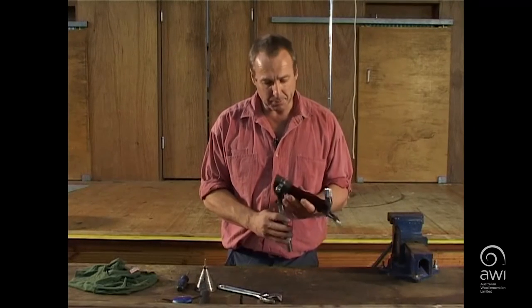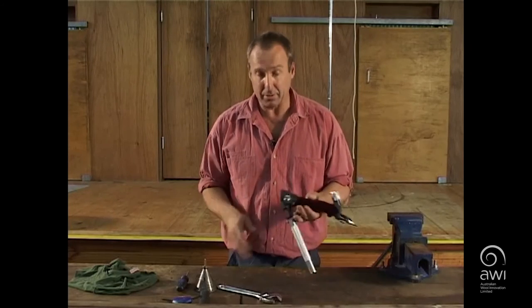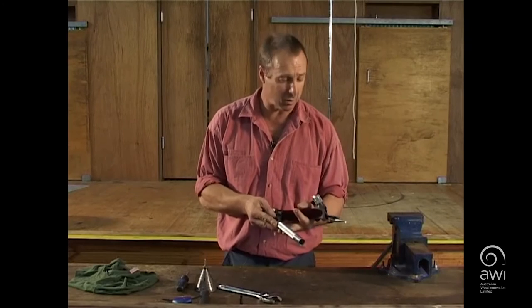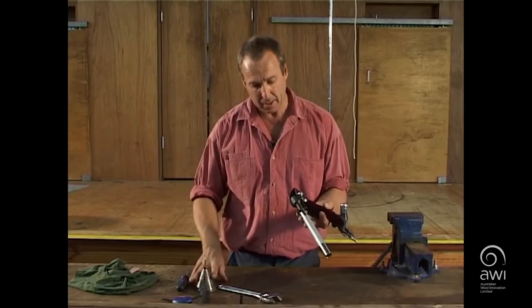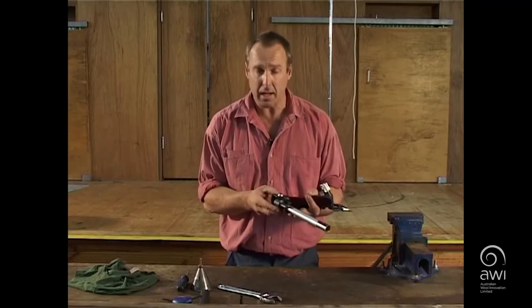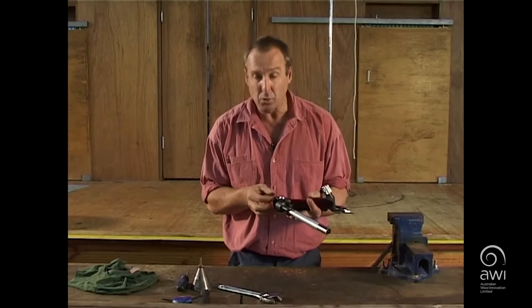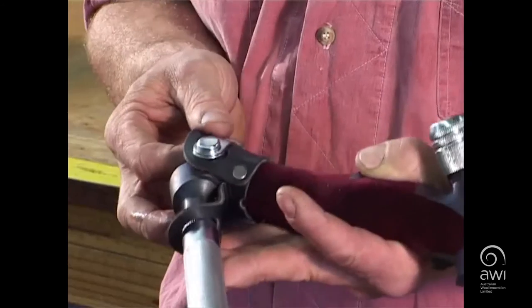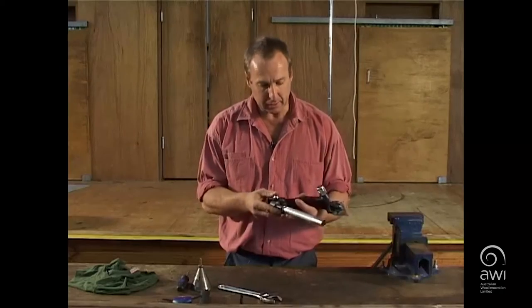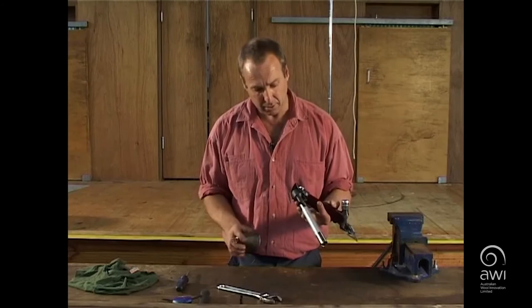Right, now we're going to look at the lubrication of the handpiece. It's important to lubricate your handpiece purely for performance and longevity. If you don't, you very quickly find that you've got overheating problems and poor performance. Now, in the back end of the 2C handpiece, we have a grease point, and that will lubricate the inner half of the back joint, which is a special feature that Beiyuan have provided to create this longevity.